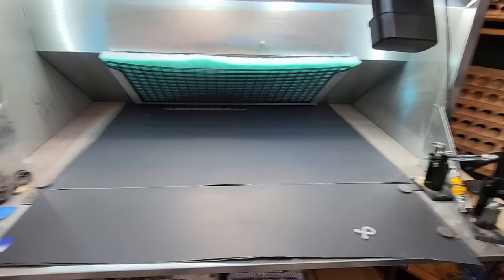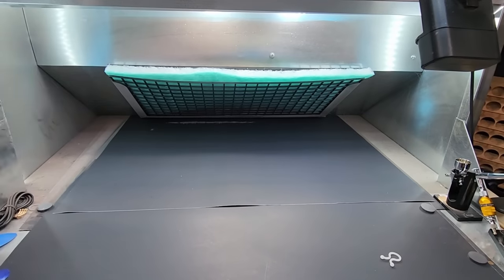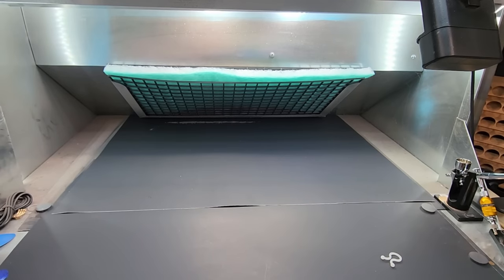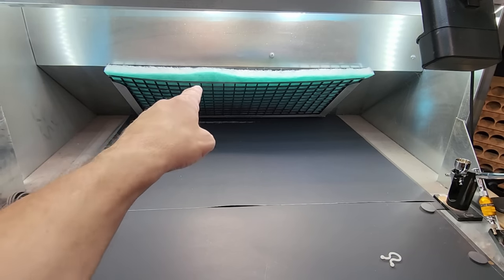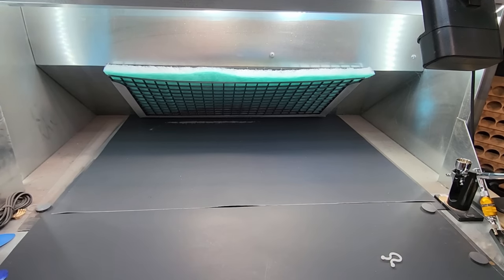The clips are a little weak — twisty ties will work better. But there it is! Now all I have to do is buy rolls of aquarium filter pad and change that out. The two grates you buy once — about ten or eleven bucks each, got mine at Lowe's. Those other filter pads are five to seven bucks each. I was using the roll in my other spray booths and thought, if I could use that filter padding here it would be awesome — and it works! I just saw that grid in the store and it gave me the idea.